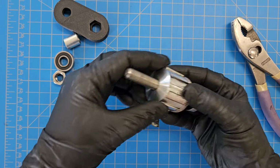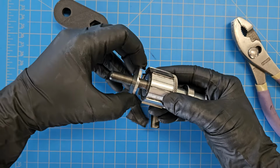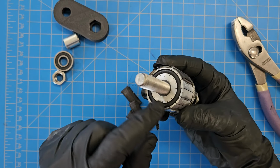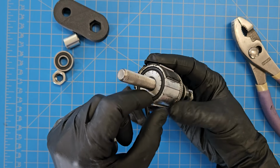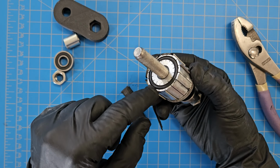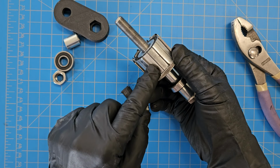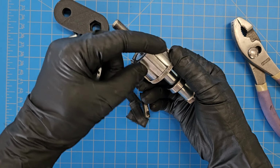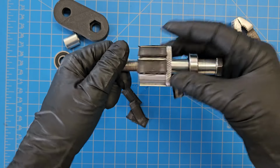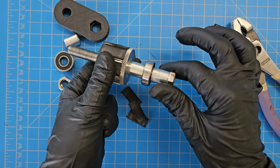Okay, so I would normally take all of them off, but I'm just going to go ahead and pry this off now. And this is how it's intended to be used. It is a part that's designed to work with these specific blades. I have a bunch of replacements for. This rubber ring pops out, lets you pull out the blades and put in new ones. You can put in more or less blades depending on the length of carbon fiber that you want chopped. This makes it about 1/2 inch. So you can easily change the blades without having to take apart the bulk of your assembly.